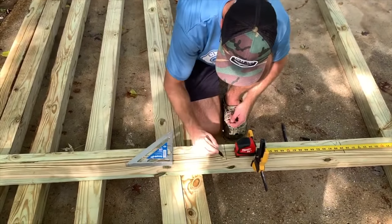Now, once you've mixed the part A and part B of the CF100 crack repair product together, it'll be kind of this putty. And you're gonna take a putty knife and apply that product to every joint in between the pieces of plywood subfloor and also on top of the screw heads. Let's start by filling in the joints between the plywood and then we'll go back and do the screw heads. So as you can see, I'm taking the putty knife and I'm filling in the gaps between the pieces of plywood subfloor. If you have large gaps, you're gonna obviously need more of the crack filler product to actually fill that in. But in my case here, the gaps weren't too major, so usually one pass was enough to fill that gap completely.